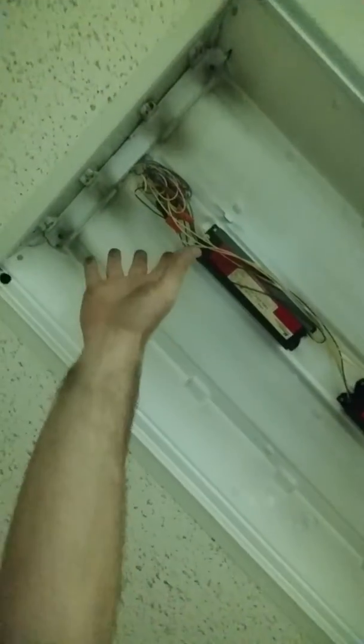And we're going to remove these 2 ballasts. Obviously we're going to remove power. And we're going to identify the older tombstones, and we're going to put 277 directly to the tombstone. So the whole guts will come out, and 277 will go directly to only one side. We don't need to do the other side. The other side will be strictly for holding the bulb up.